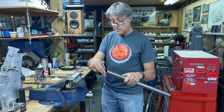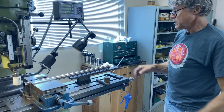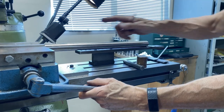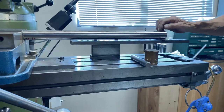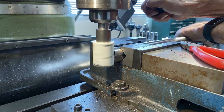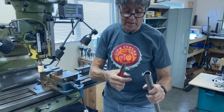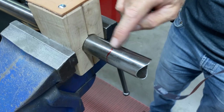We're going to miter this — inch and a half — and that's where the bottom bracket goes on. When we were building frames this piece here was always on the mill. When you put a tube in here and you see an equal space underneath, you know the tube is level, so we put spacers under there. Now if you look, that air gap should be level. I go through nice and slow so it won't leave a little bump on the very bottom. Always use a pair of pliers — it's such a temptation to use your fingers and then you cut yourself.